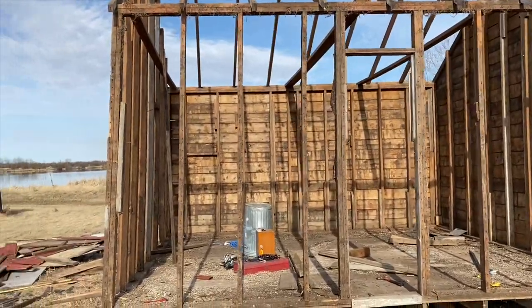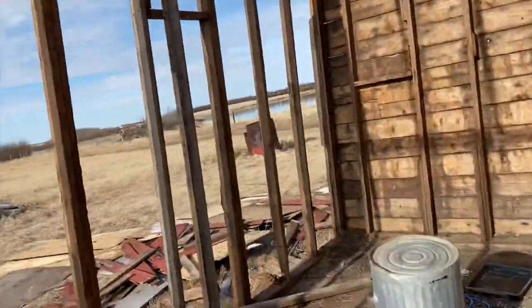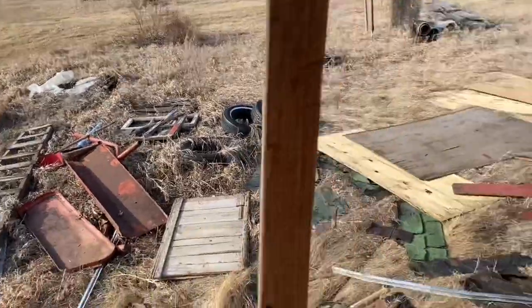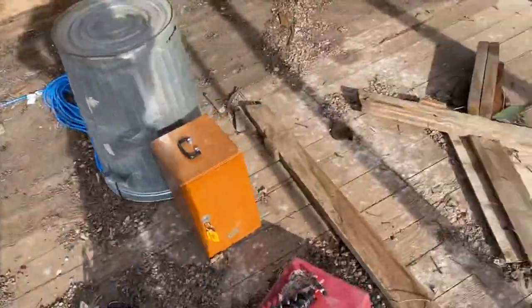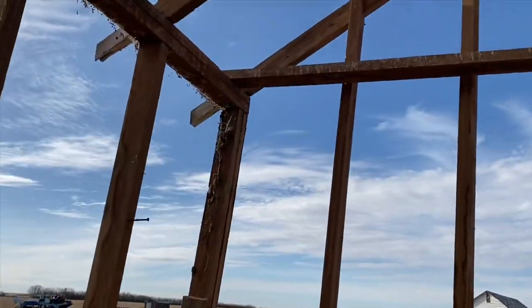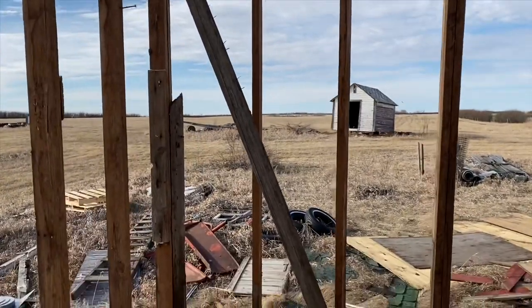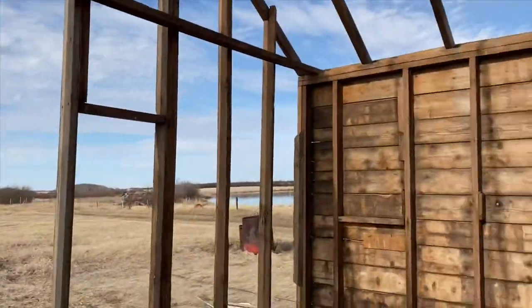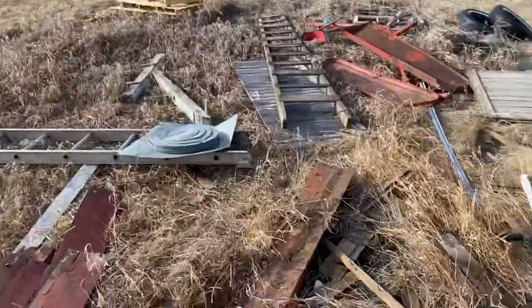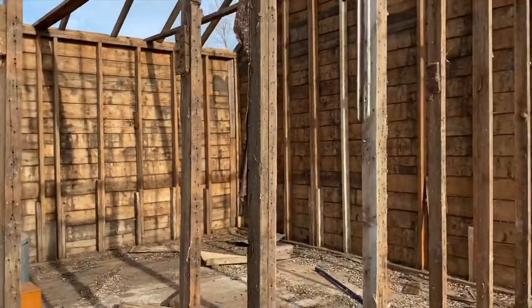I got that all stripped, but the building is pretty weak now. It's leaning pretty good and I can wobble it rather concerningly easily. So I'm going to take some of the scrap 2x4s and just put a brace up to hold it straight — just going to the top plate there — should hold it sturdy enough so that if a strong wind comes it won't pull the rest of it over. I think I will go home now and rest and tackle the rest of this either tomorrow or some other day.